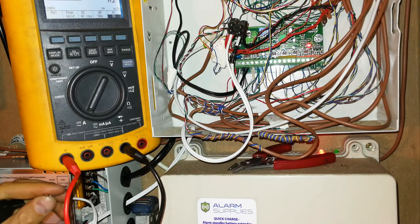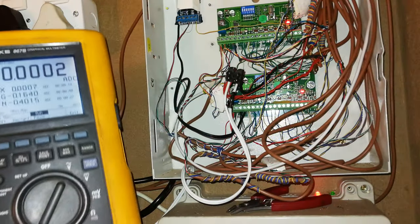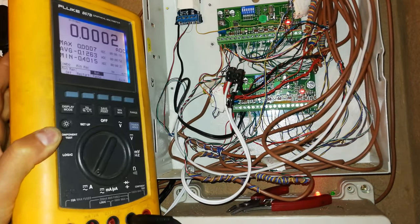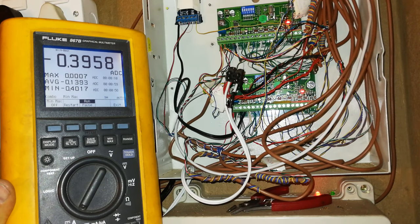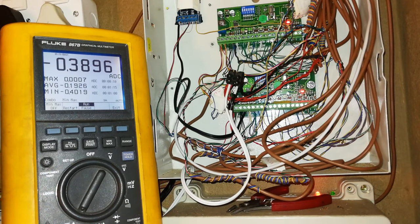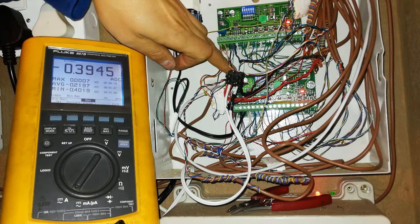So I'm just going to measure the current coming through from this power supply. Let's power it up and check. Now the moment of truth — just to show I've partitioned the loads. I'm going to connect the other side of the ammeter to the battery bank to complete the circuit — remember this is in series. You're going to see 0.39, call it 0.4 amps. What I had to do is separate the load slightly; one of the sensors had to be put here. That is very specific to this make of alarm system — this happens to be called an IDS alarm system — because it works on a serial interface and doesn't like getting different voltages.